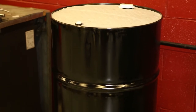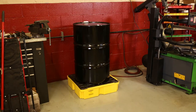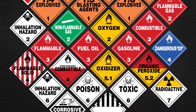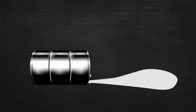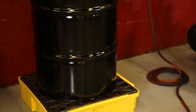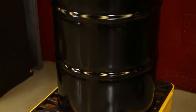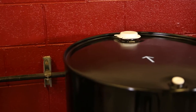Let's begin with the placement of the drum. It is important to position the drum and equipment in an area that not only is convenient for technicians, but is compliant with local hazmat regulations and codes. We recommend you confer with your local fire marshal or hazardous waste consultant about any requirements for containment in the event of a spill. Placement of your drum must provide access to shop air and a grounding source for the drum and refiller. Once you determine the best spot for the drum, locate the drum bung towards the wall.